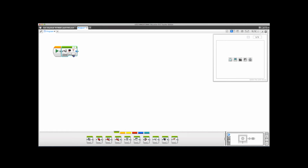Once you set that to unlimited, again, you have an option for a controller box. So if you're going to move multiple motors at the same time with multiple controllers, you're going to have to set multiple move blocks. But I can choose which controller. I can tell it that I want to talk to motor number 1, motor number 2, or both motors at the same time. Notice that if I choose one motor, then I get a power level for that motor. But because I'm only talking to one, this power mode is not available.